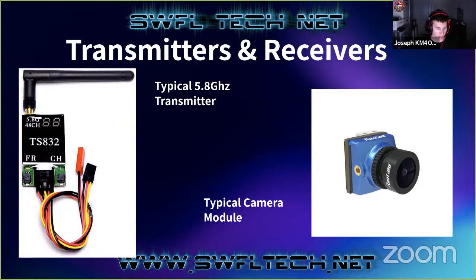A lot of these run off of a very wide voltage range, because a lot of models will have a LiPo battery in them. And so these often will support 2 or 3 different kinds of LiPo batteries. Most of these can go down to about 5 volts and go up to, I don't know, 24 volts. Mine right here can go down to 7 and up to 24 volts. So you can power it anywhere in that range, which means you can use a 2-cell lithium polymer battery to power this, or a 3-cell, or even a 4-cell. So it's pretty good, because then you don't have to put a voltage regulator on your craft. You know, that's one less thing you have to do. So it helps a lot.